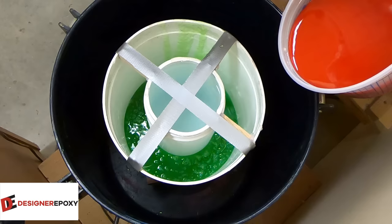But the theory of hydraulics, because a liquid is not compressible, it works and it doesn't work in this regard. I've seen this a lot in the comments about using balloons and putting water inside them. So if you put water inside of a balloon and then it goes inside of the casting and then you pressurize it, well, there's a good chance that that balloon is going to compress and it may possibly even burst. And then, of course, your casting would be ruined.